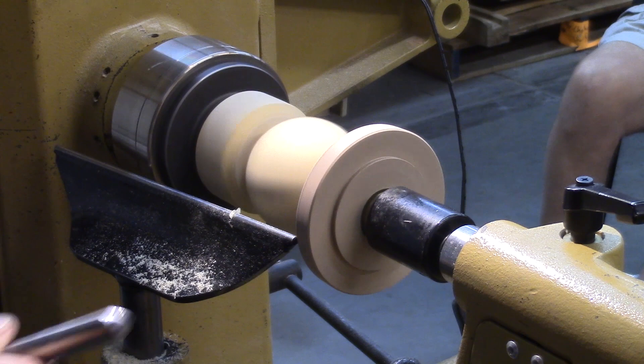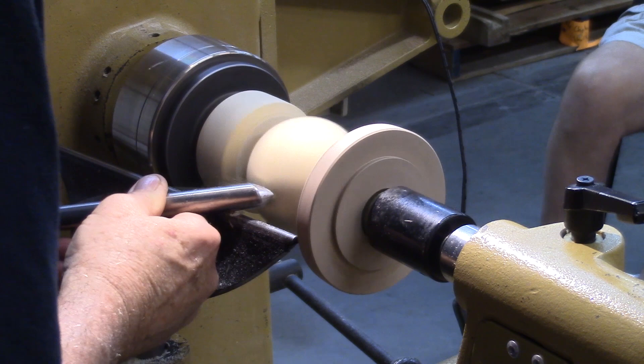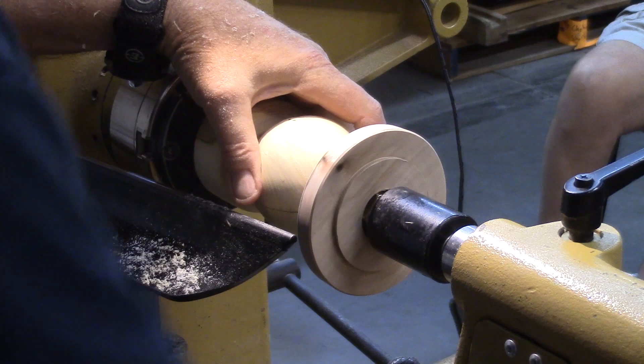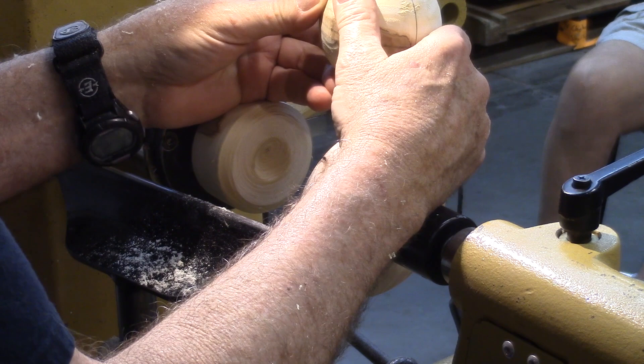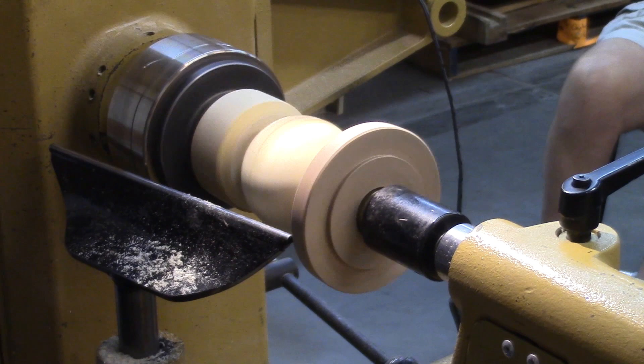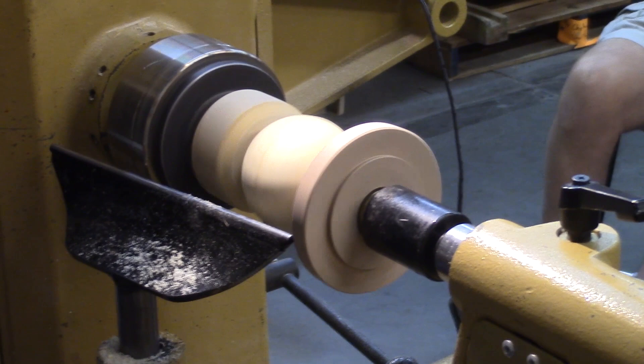You're looking for it being grossly out somewhere. Usually you're most out on each end. A couple of instructors I've had mentioned that if you want to judge the way your bowl or sphere looks, you have to take it out — it doesn't look the same on the lathe. I almost always make mine a little too long so they're slightly egg-shaped; I consciously watch for that. I've also made some with flat spots on the ends, and I'd rather have a tip to remove than to have to take the whole surface down.